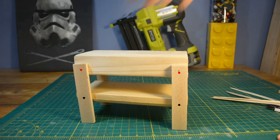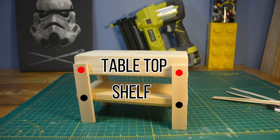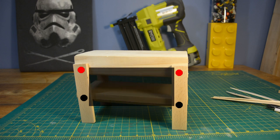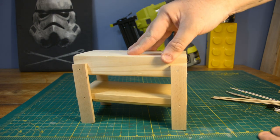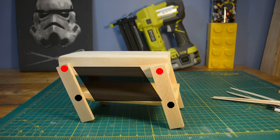If you just take a look at these four attachment points where the legs meet the tabletop and the shelf underneath — ideally these four points should make a rectangle with four 90-degree angles, but when it wobbles that doesn't happen. If we exaggerate that wobble, we see that the rectangle actually becomes a parallelogram.